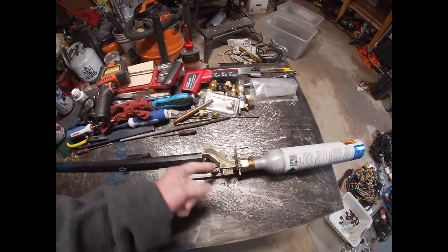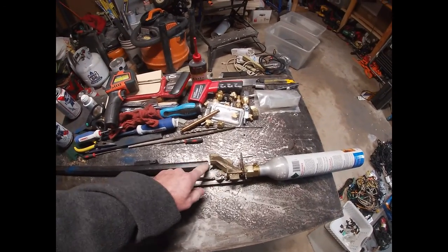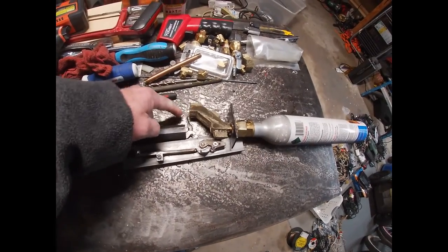Today's video is about making a brass piece for my air rifle that has an internal passageway. I did a lot of experimentation with sodium silicate and silica sand at different ratios. I found that the ratios didn't affect tensile strength but did affect the working time of the sand - the wetter the sand, the more time you have to work with it; the drier the sand, the faster it kicks off. This video shows the tests I went through, casting the metal, and the finished piece on the gun.